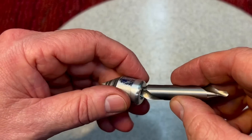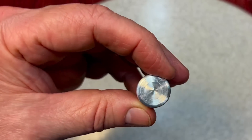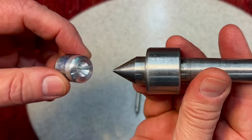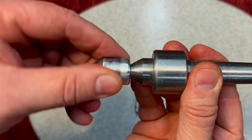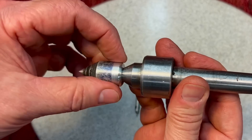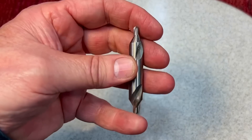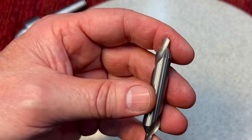I just took this drill and drilled this into here on the lathe, and you can see that's what it leaves you — that's what it looks like. If this was a long rod and we needed to support one end, we would put this live center into the tailstock. When you push this in here, you see how that fits — it is snug, it's not moving. If you didn't have a live bearing, you would put a dab of grease in there against the dead center and it would spin on the dead center. But that's how you hold it, and that's what this double-ended 60-degree center drill was originally developed for.